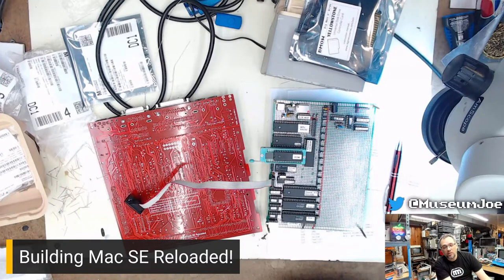I want good graphics in this thing. I want this to be a stellar 8-bit machine. I can't say on par with the Commodore 64, but I want it to be good, right? I want this thing to have a dedicated graphic subsystem, for example, with sprites and tiles, so it can do real graphics. I also want it to have an independent bitmap mode, so you can say, hi, video chip, go do the thing, and the computer can just continue doing its thing, and it's not trying to manually draw the screen like the Apple II does, right?